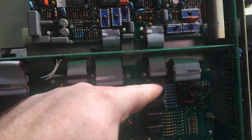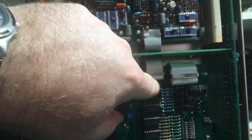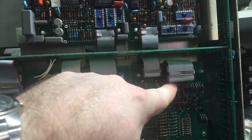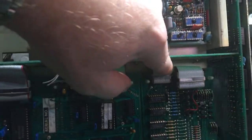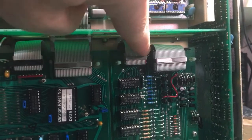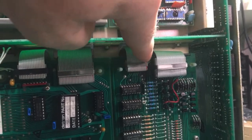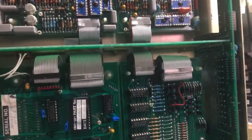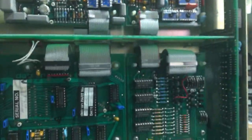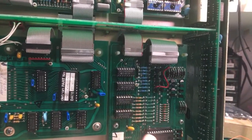I also pulled the zener diode out here and the resistor that was there. I linked these three tracks here together which are now all negatives - all on the zero volt rail. And that's linking over to the AN2 resistor network. I cut a track up here - you can't really see on this camera. I cut a track right in that corner there and linked it across to a pad right next to it. Through the whole pad - it's perfect. Which is 5 volts. So I just cut that track and linked it between the track and that pad. And that gave me the 5 volt rail I needed to do the pull-up on that. So that's pull-down for those, pull-up for that one. And I think that's all the modifications on that board, but it took me two days to figure out all the bits and pieces.